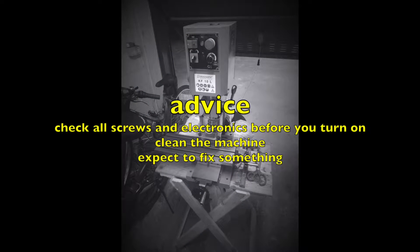I have to give some advice on buying these machines. These machines are cheap. First of all you have to check everything on the machine — every screw, every connection, and all the electrical parts. I suggest dismantling the machine before starting it for the first time, because sometimes they are poorly assembled and this can cause damage to the machine. Often the transmission goes wrong due to a poorly mounted machine.